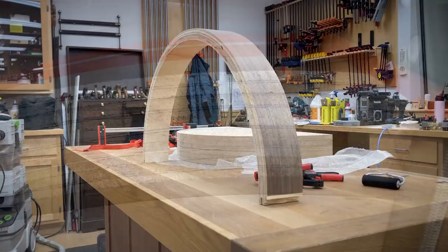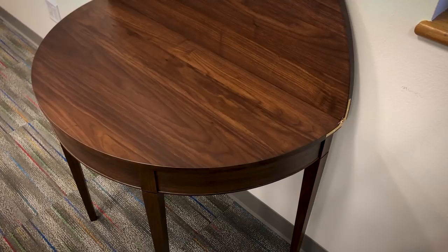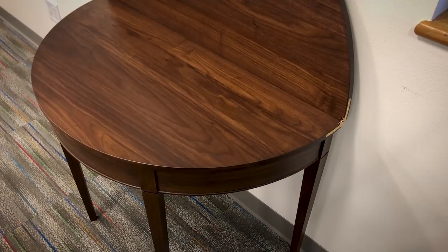It's a great way of bending. Bending plywood is not something you necessarily may have thought of, and there are other ways of doing this, but this is a pretty easy, pretty simple way. The plywood itself doesn't seem very structurally sound by itself, but once you glue it to many layers, it's pretty amazing how sturdy and durable it is.